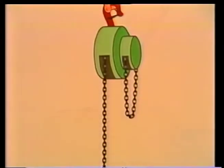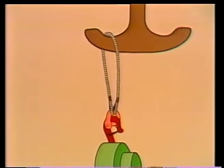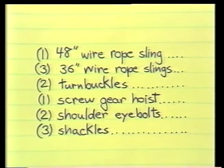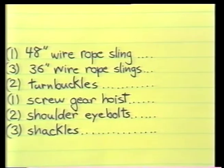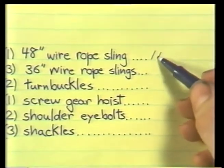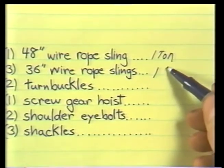Next comes a hoist, so the load can be lowered slowly through the shaft opening, where clearances are fairly tight. The whole assembly attaches to the load hook of the overhead crane with a wire rope sling and a shackle. The overhead crane provides the travel to take the load where it has to go. The rigging will have to support 650 pounds. To be on the safe side, Norris figures in an extra safety margin even though the rated capacity of each piece includes a safety factor already.